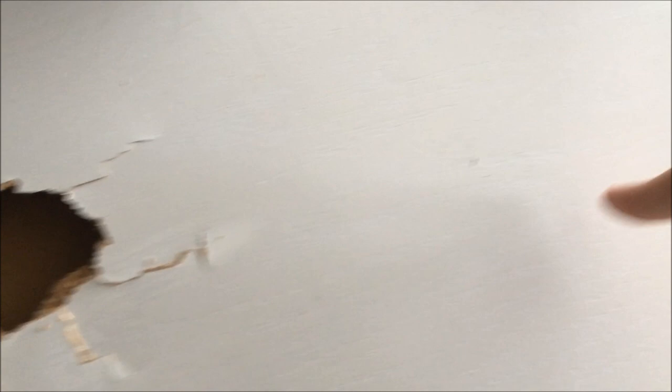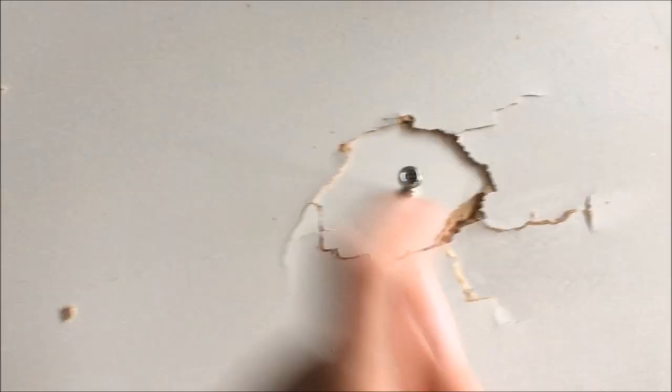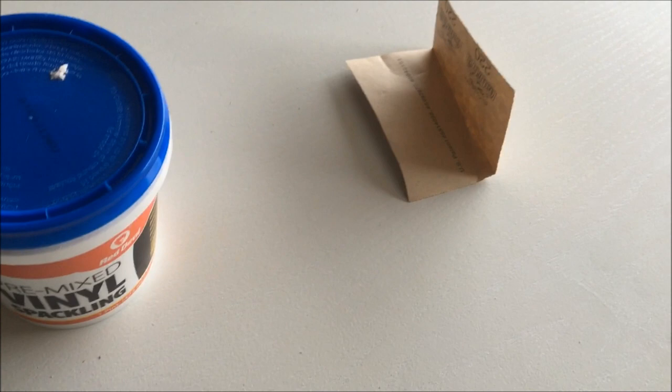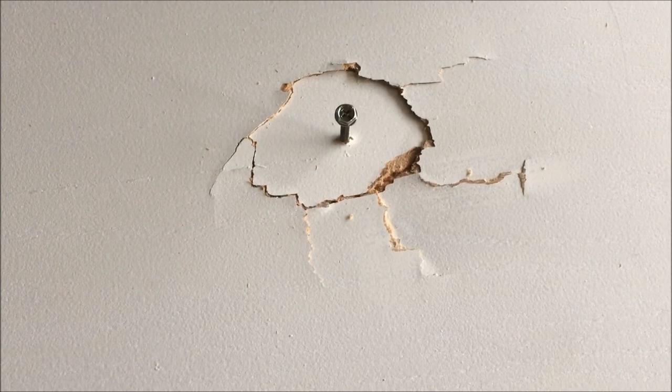For putting the main part back in, I've taken inspiration from old automotive bodywork — where they used to weld a little pin in and use a slide hammer. I've done the same thing with a screw. Put it in, and it's working: I can use the screw to move it around, put glue on it, and it holds itself pretty good. After the glue is dry, take the screw out. You'll probably have low spots — apply some spackle, go over it with sandpaper. That's basically how I plan to do the main repair on this hole.